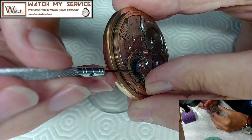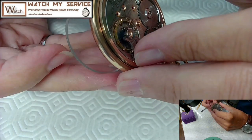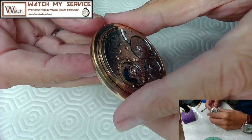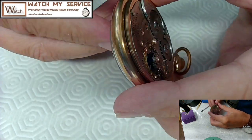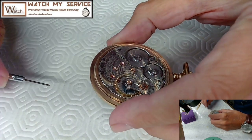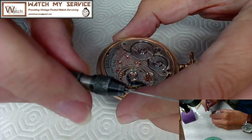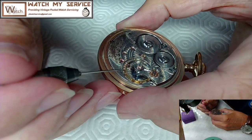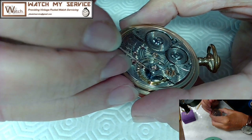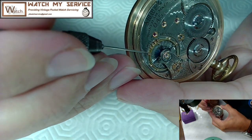You really have to be careful — if your blade slips into the hairspring, you've got hairspring issues. I also need to seal this crystal in better; it's popped out, but I've got a crystal press for that. Now I've got a needle on a vice grip, which is useful for getting the hairspring stud — just pushing it down from where it resides. The hairspring is riding right there, so I can just pull that out a bit.